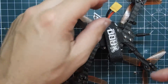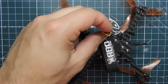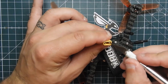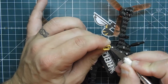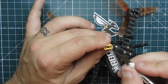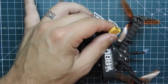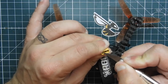With these XT30s you really can't get a toothpick in there. What you would do with the XT60 — which I'll show you in a second — is just stick it in the hole. But since the XT30 is so small, I recommend using something like an Xacto knife. Be very careful, and just put a little bit of pressure to bend one of those little tabs slightly. If you go too far it'll just break off — there's a point of resistance and then it just snaps. This avoids having to replace your XT30s or XT60s. Let me do the same on the other side, maybe with a little more force.